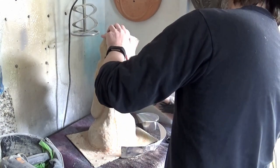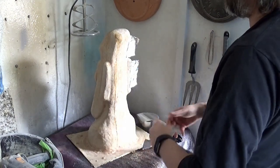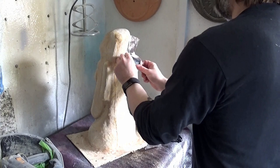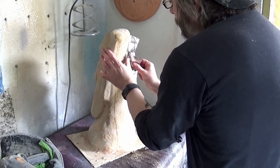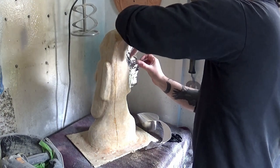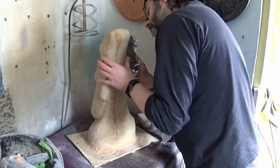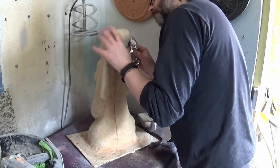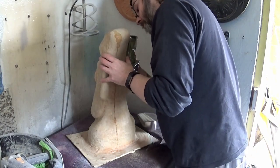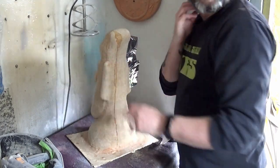Aluminium foil works for me — I quite like using it because it's pretty instant. Obviously it's a bit sticky and a little bit fiddly but once you get the hang of it it's okay. There I am placing pieces of cut up aluminium tape around the latex mold. I've made sure the latex mold is clean and dry before sticking on the pieces of tape. There'll be a few parts to this series of videos.